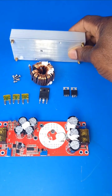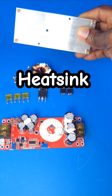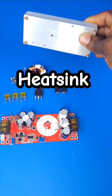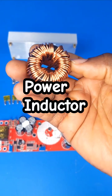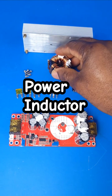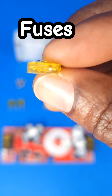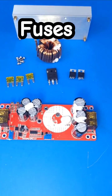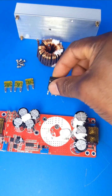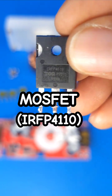Here are the major components that you can find on this board. This is the heat sink, and this right here is the power inductor. From there we have the input power fuses — these are 20-amp fuses and they have three of them connected in parallel. And here is the drive MOSFET; for this module they're using an N-channel MOSFET.